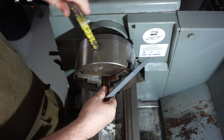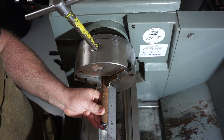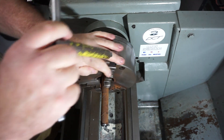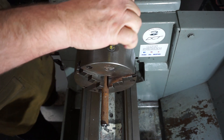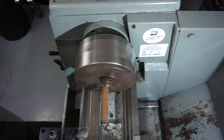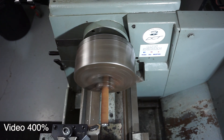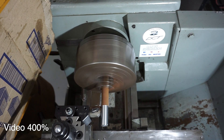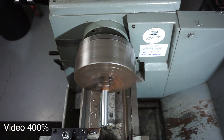I'm just going to place some of this old bar stock in the three-jaw chuck. This is stuff Wayne had laying around and kicking around his backyard. It's roughly 21 millimetres, so that's probably about 13/16th of an inch from memory. I've got to machine this down — this round bar wasn't on size. Just quickly place the work and some parallel turning. I've sped the video footage up here so it doesn't bore you. My depth of cut here is 50 thou, just over a millimetre, probably 1.2 or so, and I do two cuts. You can see me shielding myself with some cardboard there so the chips don't fly all over the floor.